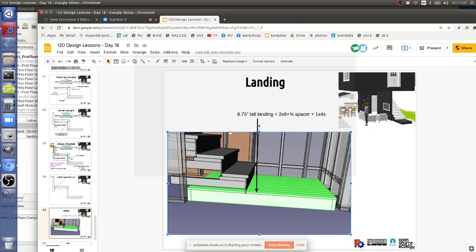If it's five-eighths, then the wall panels - they're five-eighths. If it's half, it's half plywood - might have some in storage. The point is we need to maintain this last one. The spacer has to be a one-by because that edge is going to show, and the edge of plywood is not really presentable. We probably trim it up - trim the front. But if you use a one-by, you don't need to trim it up - you put it at the bottom and it's kind of like a little effect there. If you use plywood, you're creating more complications for finishing.